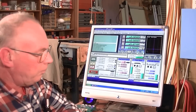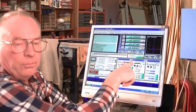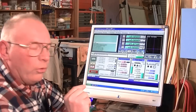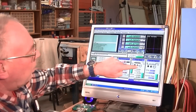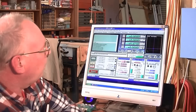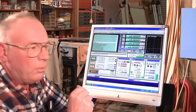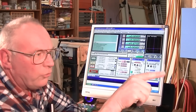So now what I'm going to do — this is the feed rate, and it's set up at 100%. What I normally do is start a program at somewhere less than 50%. I'll start at about 30% until I'm sure that everything is okay, but I've still got a chance to hit the e-stop if things aren't quite going right.